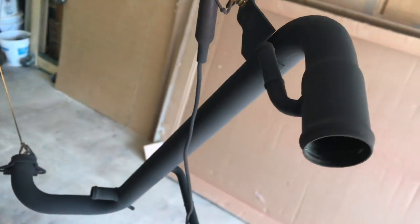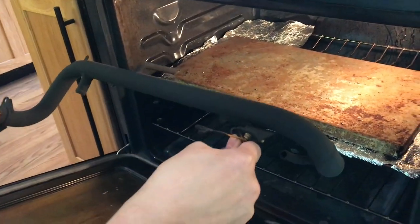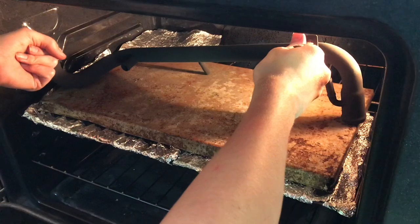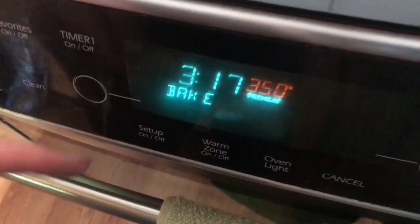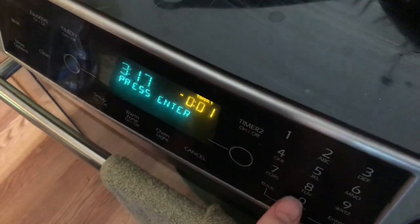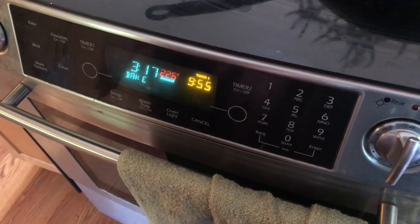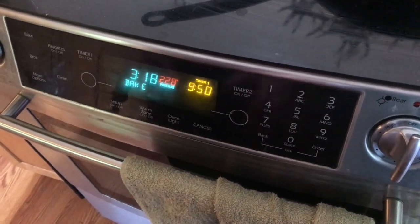I think I've got all the powder that I can on here, so let's go ahead and put it in the oven. Take off the ground clamp. We're going to very carefully put this in without bumping it on anything. So at this point it's just like baking a cake. I have it set at 350 degrees and I'm going to set a timer for 10 minutes. What we're checking for is something called flow-out — at a certain point it's going to start to get shiny, look like it's starting to melt, and then at that point we can turn it off and just let everything cool down.